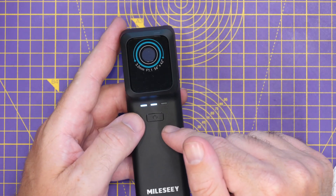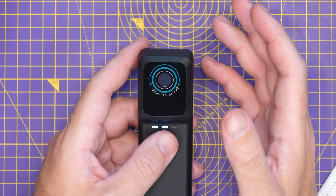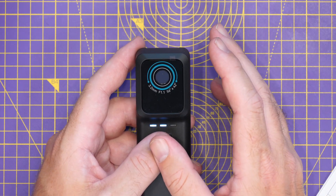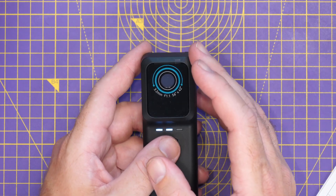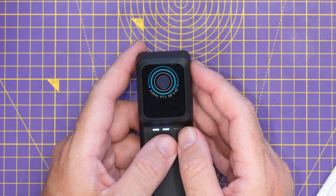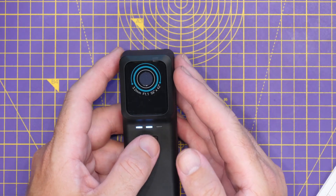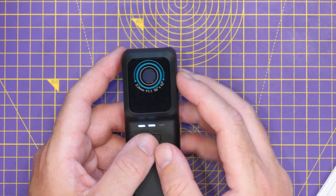The TP2 is really designed for standard thermal imaging — looking at wiring, looking at boards from a distance. What it isn't going to be ideal for is board repair where you want to get in close; the version with variable focus is the one for that. The minimum focal distance on this is 0.3 meters, so you need at least 30 centimeters to get a good focus on the thermal imager.